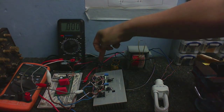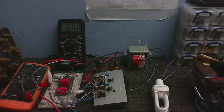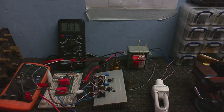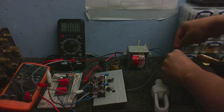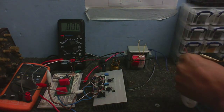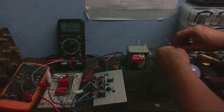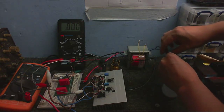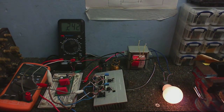So I decided to use a 9-volt battery to power the oscillator circuit and power the rest on the 12-volt power supply. Let me just plug the battery back in. Now the transformer is making a much more suitable noise. I'm going to try with the other bulb again and see if it comes on more steadily. Okay let's see what we get now - that seems more reasonable.